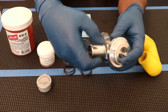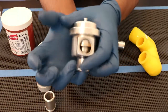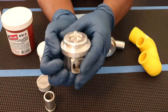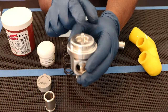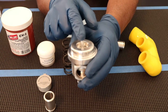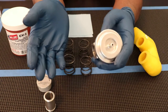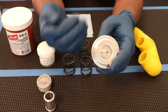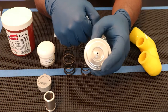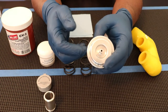You take off this side pipe, and if you look inside here, there's a cylinder, a valve that goes up and down. I can push that and it moves. The way it's actuated is by the vacuum on top. Vacuum is applied to this fitting where you let off the gas and there's vacuum in the intake manifold. It then releases the pressure so that the pressure doesn't go back down your piping to your turbo and slow down your fan and your turbo from spinning. It keeps your turbo boost up for when you get back on the gas.